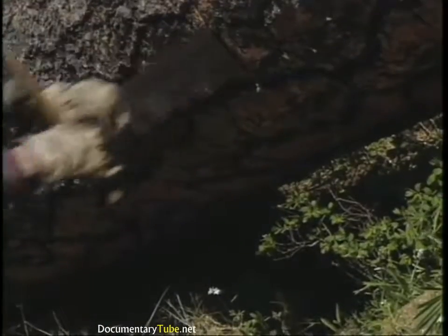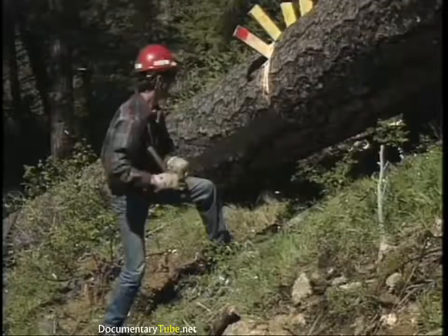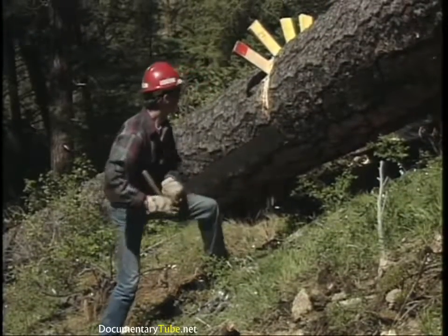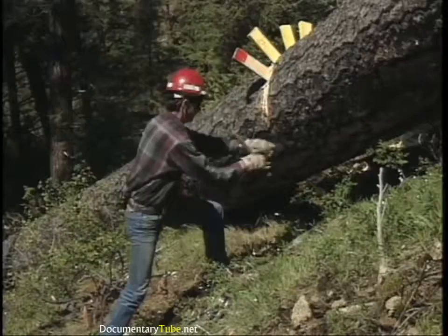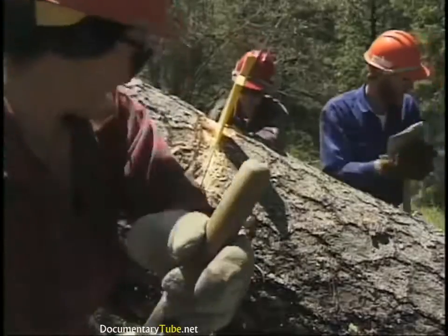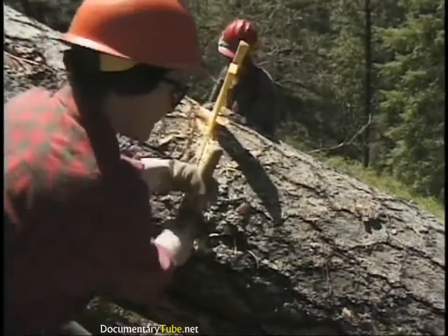As you get better and better at running it, you'll hear it change. It'll change from sounding like it's working, going through the wood, to a point where it's singing. And when that happens, there's almost no effort in sawing. You can pull with one finger, and each person can just pull it back and forth. And they can tell when they're doing it right, because the saw will sound better, the chips will fly, nobody will be pulled off balance. But it's something you learn as you work with a partner.